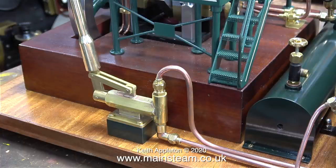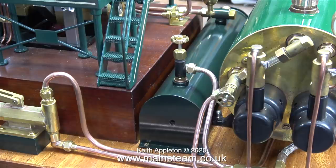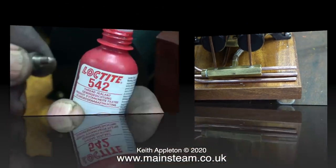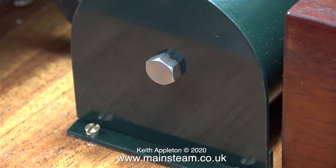It's very important when you build a steam plant like this to make sure you remember to tighten the unions — frequently I do not until I steam test it. Here's a shot of the three pipes terminating at approximately the same place; I still need to make a bracket to keep these all neat and tidy. I'm using Loctite 542 to seal the threads on the two stainless steel bolts that screw into the end of the condenser.